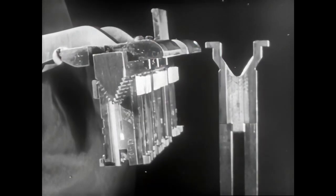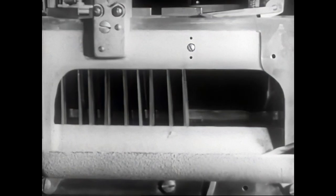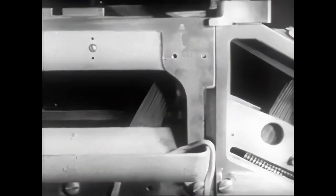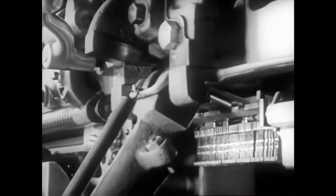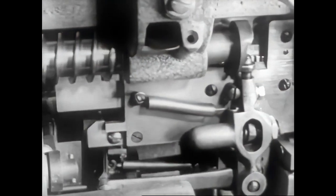The space bands, which do not have teeth, remain in the transfer channel. During the second closing of the transfer levers, the spaceband pawl engages the spacebands and returns them to the box. The distributor shifter retracts, allowing the second elevator to seat at the distributor. Then the shifter pushes the mats into the distributor box.